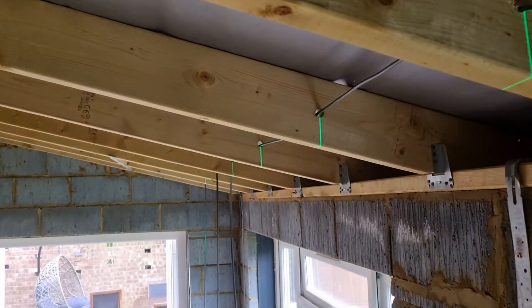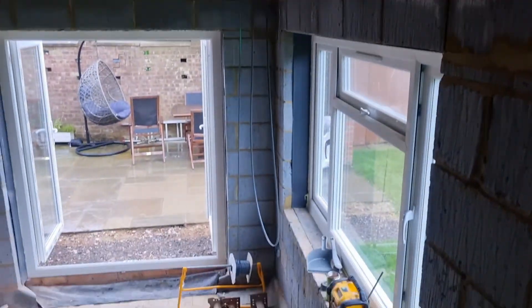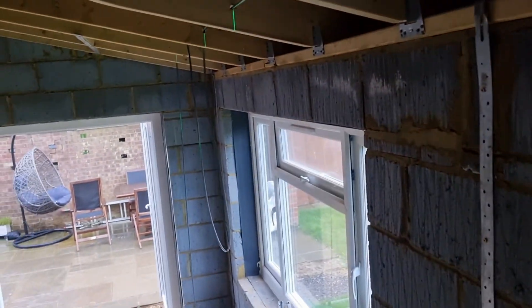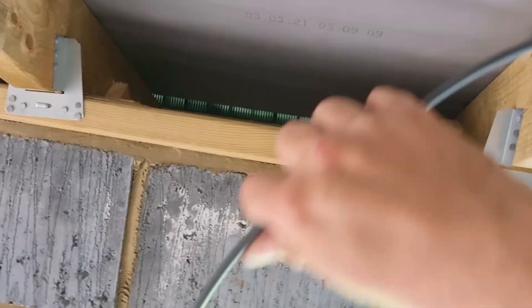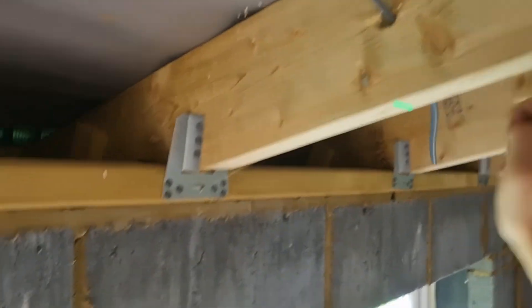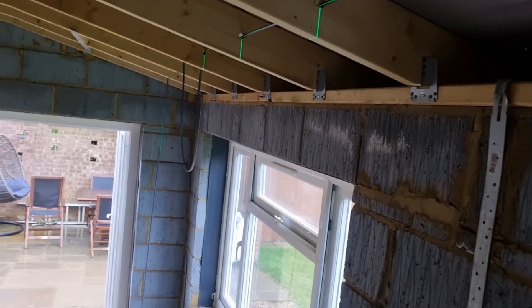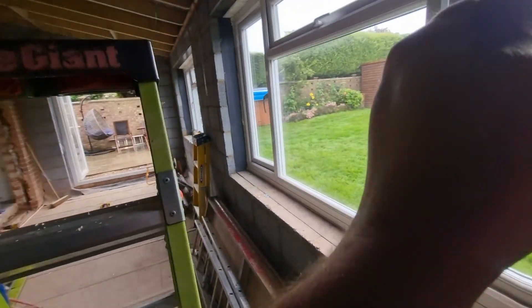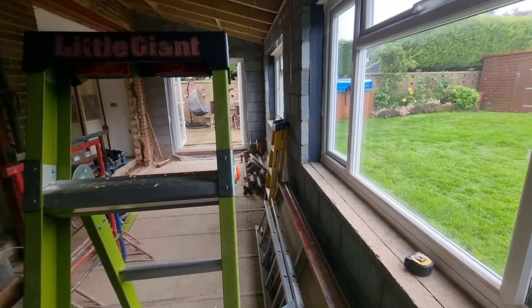Using the laser through the joists to get the cables nice and in line where we want them. Then off the cable reel, loop a bit off and thread it through for the next one. I keep the cable nice and straight with no twists in it — easier to do when on my own so I can pull off however much I need.